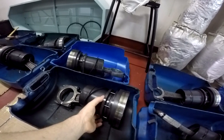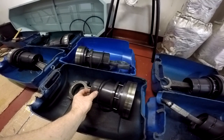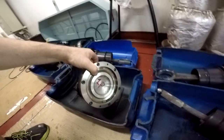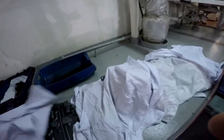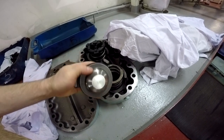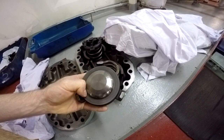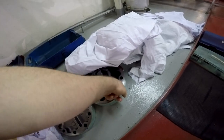And this is where this unloading will apply, in this place. So by pushing this, there is a change on the valve. And this is how the air condition will be unloaded. There will be no load, so it means the valve will not compress the freon. The freon will be recycled only there and will not be delivered to the delivery valve.